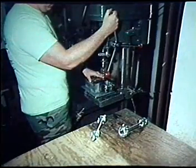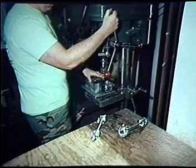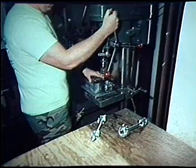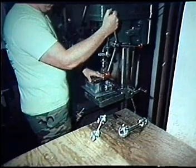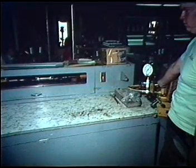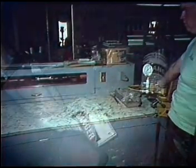Sky Genie shafts are casted of a special aluminum mixture. 3 shafts from each lot are sent to an independent lab and pulled to destruction in excess of 10,000 pounds. The drilling of holes for thumb screw and detent pin is a carefully controlled procedure. Each and every shaft is test put to 3,600 pounds before being shipped. Quality control is maintained throughout the procedure, and each shaft is stamped with lot and serial number.